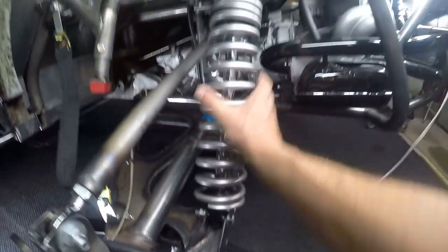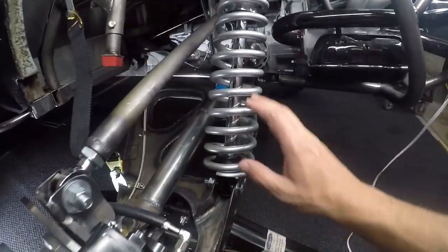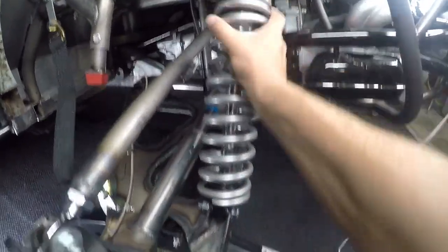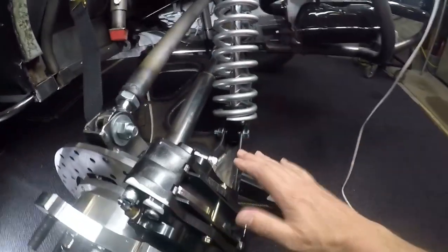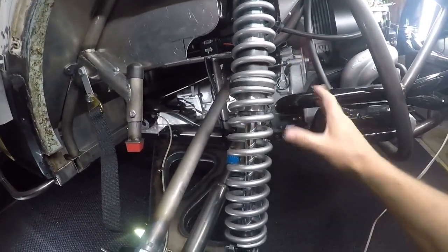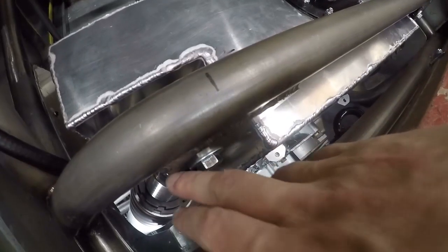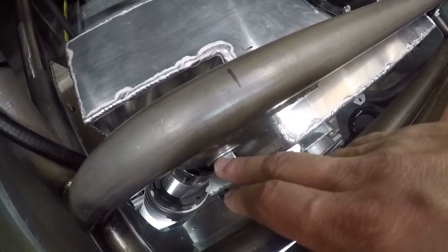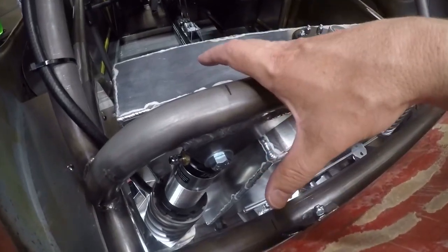When I went to the A-arm suspension, the location of these shocks completely changed. I had determined my full compression and my full droop, so once I could simulate that, I could start calculating where these shock absorbers could go — and for the most part, that just ended up being a whole bunch of trial and error. The first thing I did was put the suspension at full compression, put the shock absorber on here with the springs off, fully compressed, and set it up so that it was 90 degrees off of the control arm. That would be a good starting point for my maximum compression. From there, I was able to start figuring out roughly where the shock would connect up at the top of the chassis, but I had a bunch of jigs in here so that I could adjust the shock absorber in and out and up and down as I was trying to determine where my final mounting location was going to be.